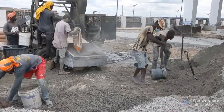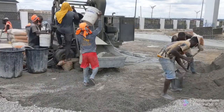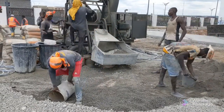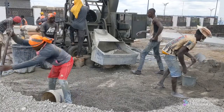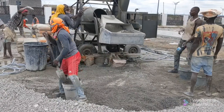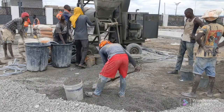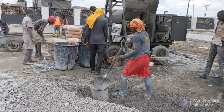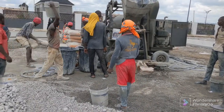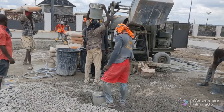When you're loading buckets all day and putting material into the funnel, you can easily lose track — I've seen it happen many times where a mix comes out and all you have is rocks, or all sand, or too much cement. That is very bad for the quality of the concrete. By arranging our mix this way, it helps us get a consistent mix all through the day, and that makes the quality of our concrete consistent. We come out with a very consistent concrete of the expected quality.